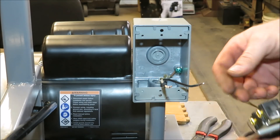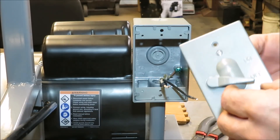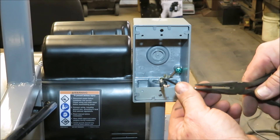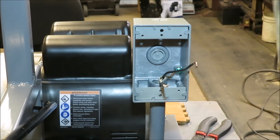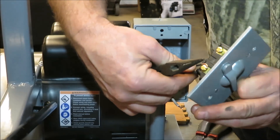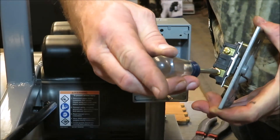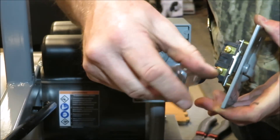Okay, now we're going to put the black one in as our power in — we're going to put it on the bottom. Now if you watch the way you turn these: when you twist this wire, you always want to twist it in the clockwise position. That way when you tighten up the screw, it tightens with it — it'll pull it around, not pull it out.